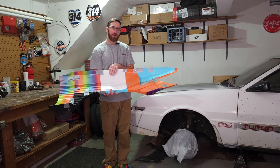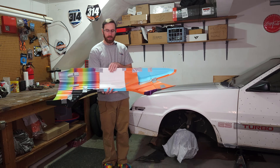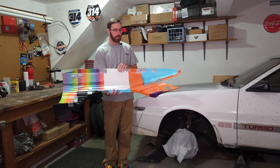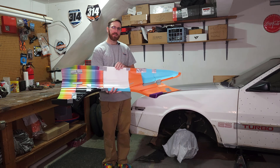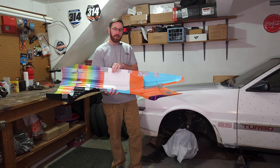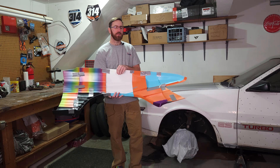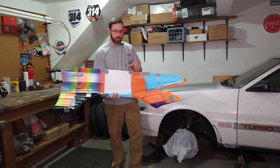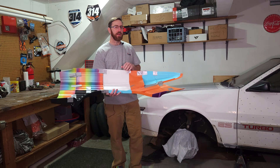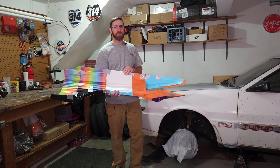This big piece here was purple originally, and I printed it probably four or five times. Each time on that machine, even though it's relatively fast, we're talking 15 to 20 hour print times. What ended up happening is the last version I thought was going to be good ended up delaminating, and after I glued it all together it just started falling apart — it wasn't very firm. That caused me to shelf this thing for quite a long time. Every time I'd say let me try to print it again with a different material, I would just have problems.